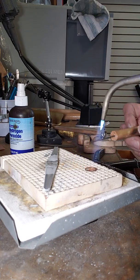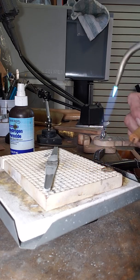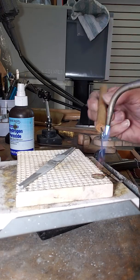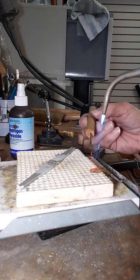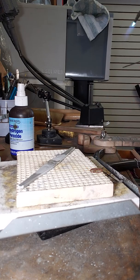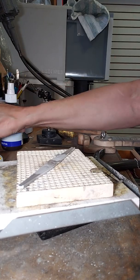If you wanted to use something from a silver-plated tray, you wanted to punch out a disc from a silver-plated tray or cut out a brace from a silver-plated tray, you can do that as well. All right, I just cut this disc out with a circle disc cutter, like that.